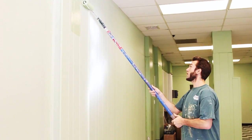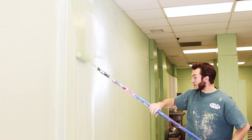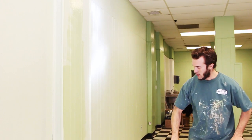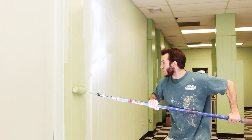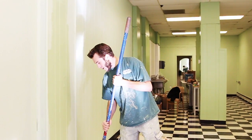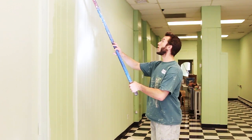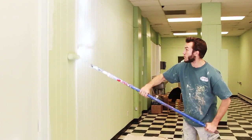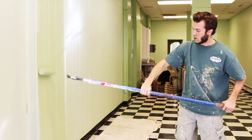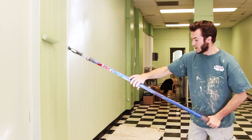Principal rule of painting: let the paint do the work. You see people painting their houses and they get all the paint spread out, start running out of paint, and they start pushing it trying to get it out. You don't want to do that. You want just a little bit of resistance. I'm not trying to push the roller into the wall — I'm monitoring the paint. I throw the paint up onto the wall and then move it around. You can see I'm using my hip to get the roller to work, not standing here using my arms. There's the hip twist — you can see the hip working.